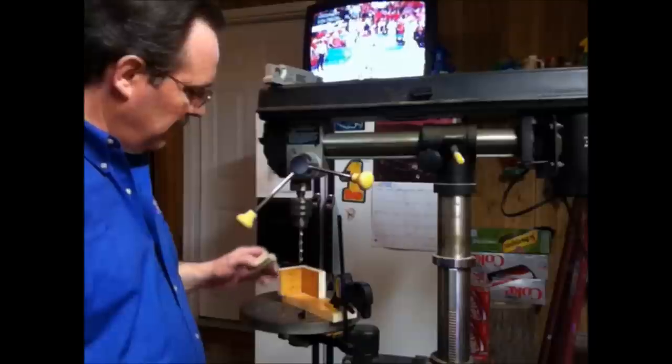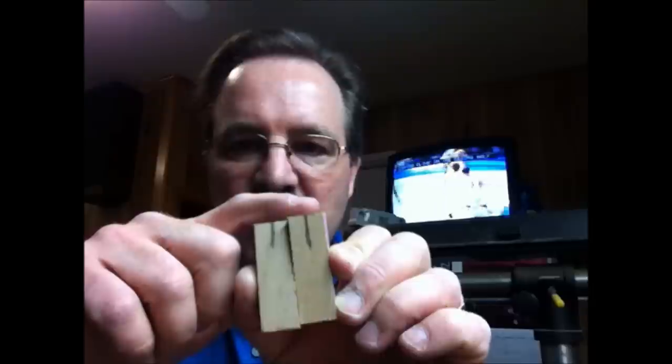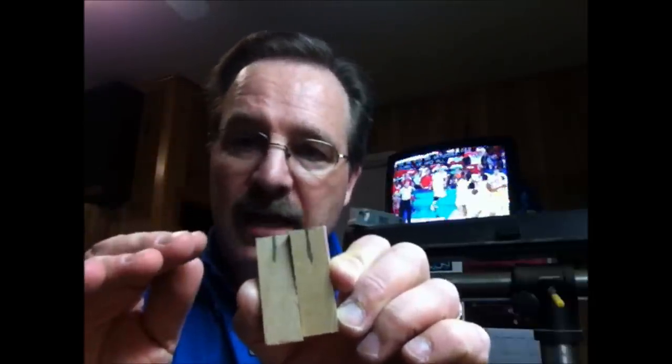I'm preparing to drill the blanks out using my drill press since it's convenient, but I'll use the homemade vise to demonstrate. One thing to point out: we made perpendicular lines on the blanks — always start drilling from that side so the grain will line up. Even if you veer off a little with a handheld drill, the grain will still line up. I'm going to chuck up this blank in the press and drill it out.